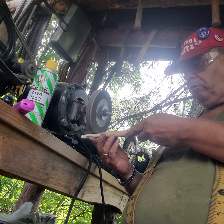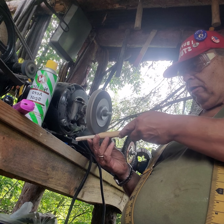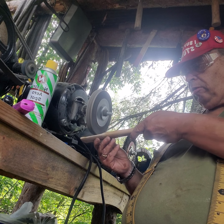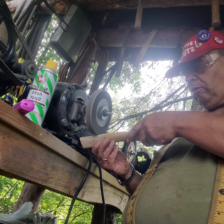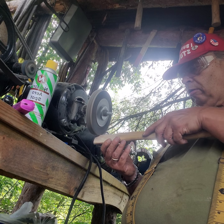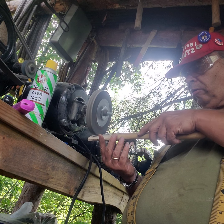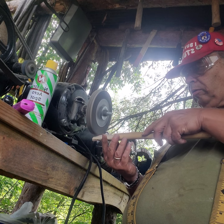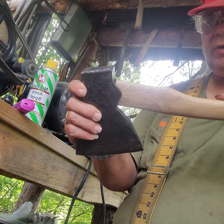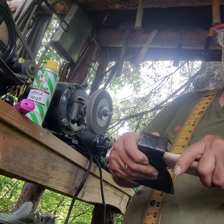The inside of the eye of the hatchet was a little messed up, so I straightened it out. I put a bit of an edge on it — I'm not going to sharpen it razor sharp, though I could. I took out some of the damage where somebody had been beating on it and worked on the eye so the handle will fit. I've got a nice old handle here that I cleaned up and sanded so it'll fit. Now we have to get the handle on all the way. I think we'll grind on it a little bit more.